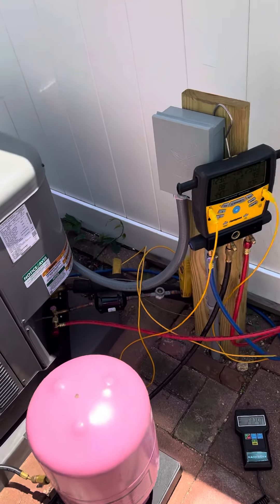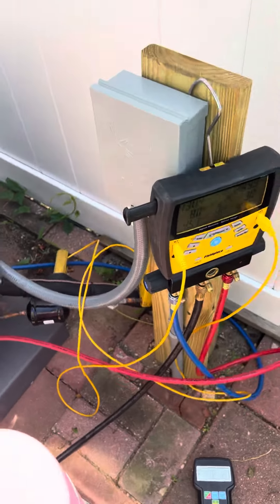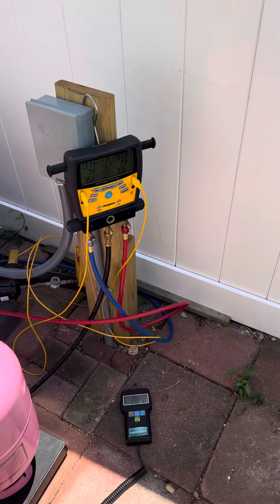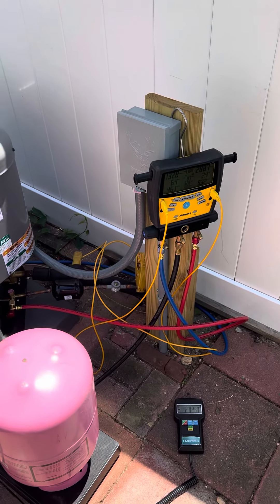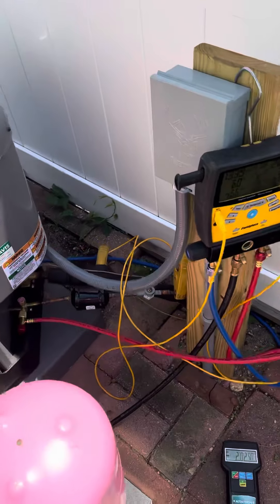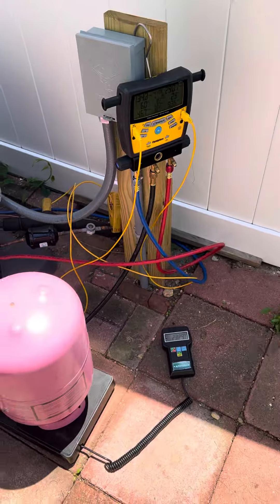Looking good — the house is starting to get cold. I have a little sight glass there, I've got a few bubbles left in there. I like the sight glass so you can see what's going inside, but I don't rely a hundred percent on that. I rely on sub cooling and superheat — that's the way to go. But it's always nice to see what's inside that system, see when the condenser's nice and full and has enough refrigerant, at least in the condenser. Then you can dial it in once the house is nice and cool by the sub cooling and everything.